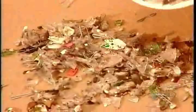The bales of paper drop down into the pulper, a giant tank with an agitator similar to what you see in a washing machine. It mixes the paper in lukewarm water for about 10 minutes, transforming it into what's known as pulp and screening out all the bits of metal and plastic.